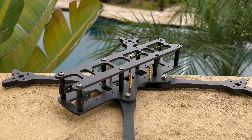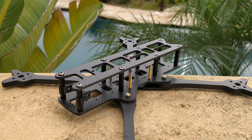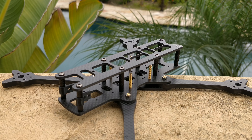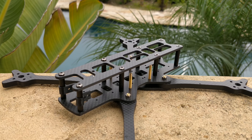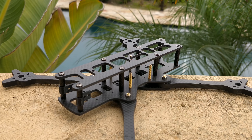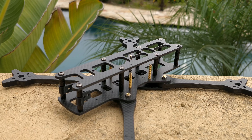At this point, pretty much all flight controllers fly the same. There are some new ones on the horizon — we have one coming as well, and there are improvements with multiple gyros and the guy from CleanFlight is making something too. Things fly really, really great right now. It's easy to pick reliable components, wire up your electronics — which takes most of the time — then screw on the motors and solder them up. Motors and props are really what impact flight performance more than the electronics you use.